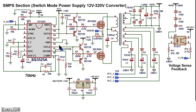On the next stage, pin 11 goes low and pin 14 is held high. Now Q6 turns on and Q5 turns off. The MOSFET Q2 will turn off quickly because the transistor Q6 will pull down its gate to ground.